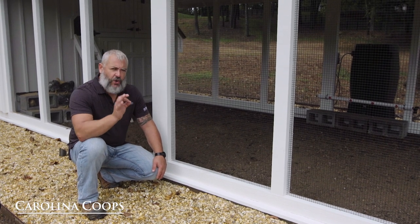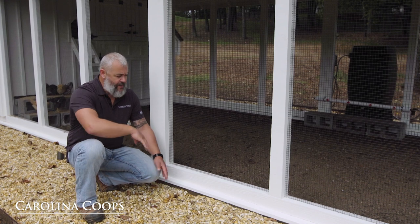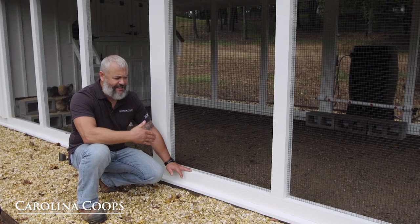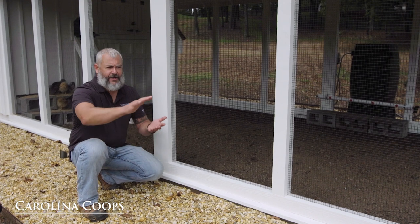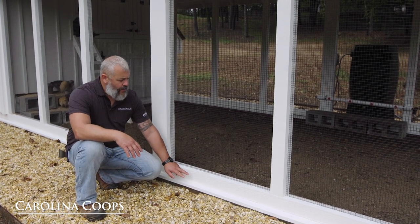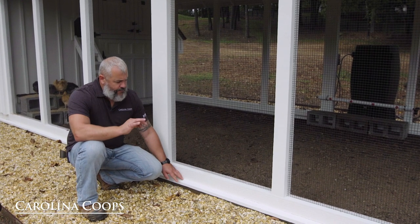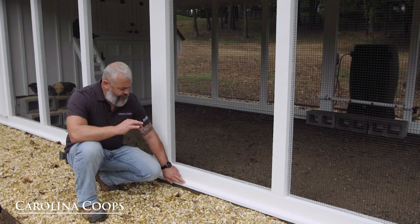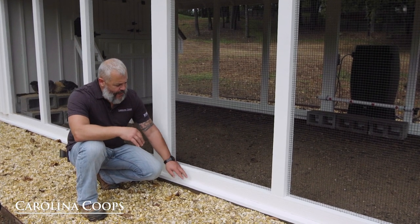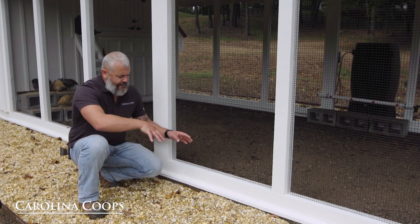You do not want a pad on the inside — you do not want chickens walking on concrete. You want the forest floor. We have the six-inch perimeter, and on top of that you want to make sure we can attach this coop. The easiest thing to do is what you do in homes: you set your cinder block or concrete walls, then you put on your sill plates. This is a two-by-six pressure treated lumber that is tap-conned down into the concrete. They take a router, put a chamfer bit on it, and you get a little 45-degree angle — not necessary overkill, but it makes for a very nice detail. Now we can screw the walls down into the sill plates.